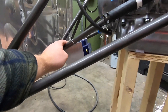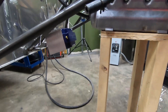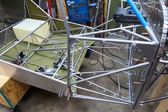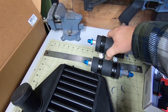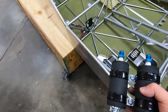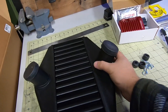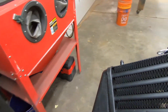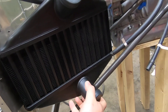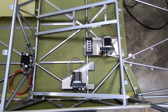I did learn that the EarthX battery shouldn't be inside the cabin unless it's a vented model, so I moved things up front to the bottom of the engine mount. I'll leave it mocked up there for now just to make sure I like it there when more of the systems go in as we progress on the firewall forward. I've also got two Walbro GSL 393 pumps. They live somewhere up under the pilot seat similar to a factory installation, along with the filters that I haven't gotten yet. I'm thinking the regulator will live up here someplace on the left side of the engine mount, and the intercooler will probably be someplace on the right side, although all this engine-related stuff is just an initial guess. There's a million sensors and components to figure out, and as I get more parts it's bound to change and shift around, but I'm making good headway at figuring out the details.